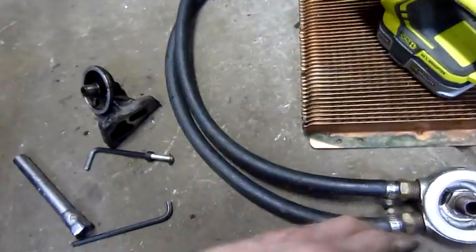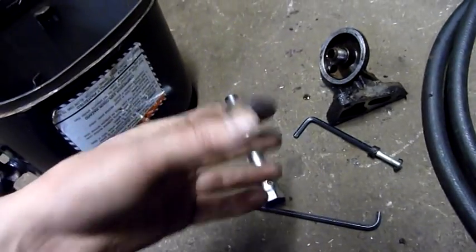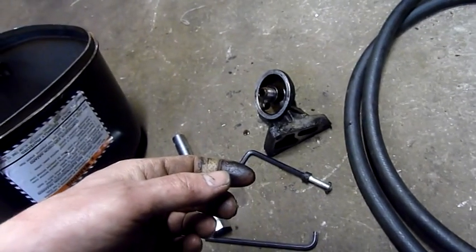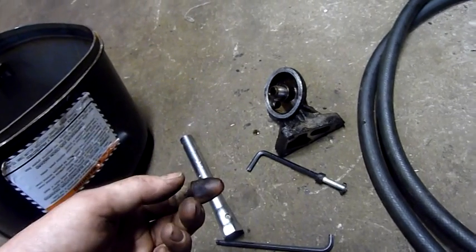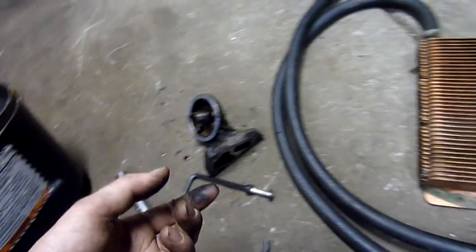So I've got an oil cooler, oil filter, oil reservoir, pump, lines — all that stuff ready to go. I've just got to work out pressure regulation and a fan, and that's about it. I could spin that turbo up with compressed air no problem — I'll use the big centrifugal blower and just do a dry test without a combustor. Then we'll look at combustor design.